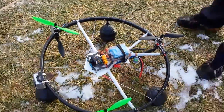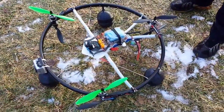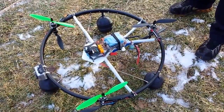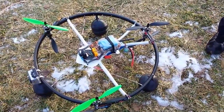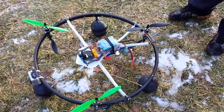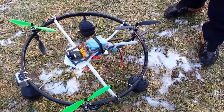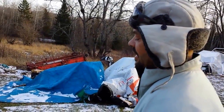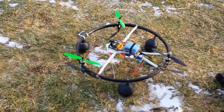So what I'm saying is that the broadcaster is using 2.4 gig bandwidth, and with the right antennas, I would suggest probably maybe a circularly polarized 2.4 gig antenna set, one on the craft and one on the ground. And these are both two-way. All these antennas are two-way. You would have to have on board the broadcaster, and you can maybe say to the manufacturers, what we need is a modem or some lightweight Wi-Fi satellite connecting device that has SMA output for external antenna.